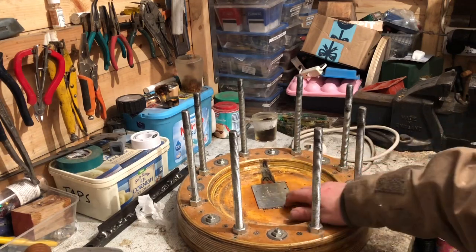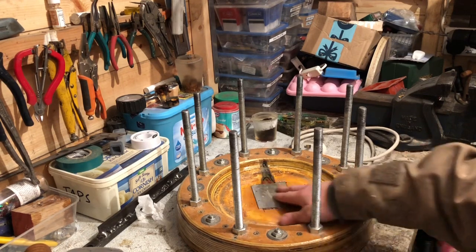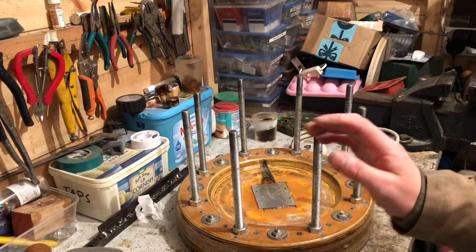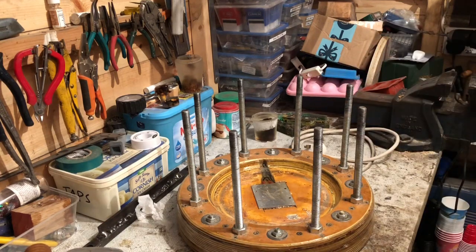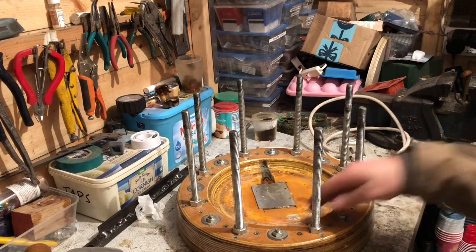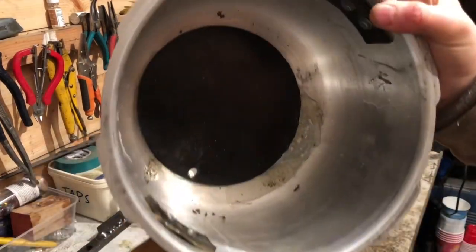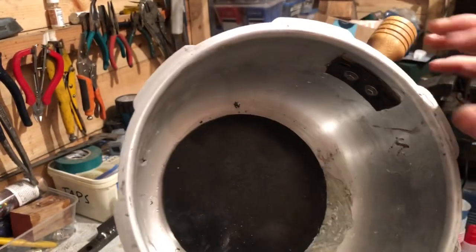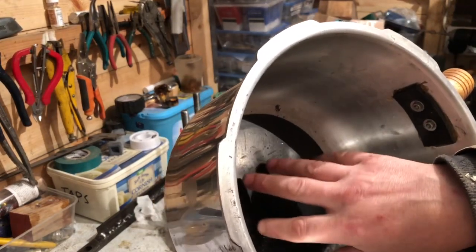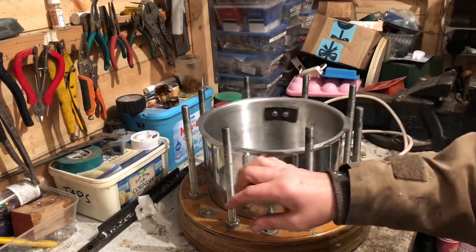That is a heating plate — I think it's about 30 watts, it might be 20. Sitting there it'll heat up quite hot, up to about 70–80 degrees. It doesn't heat up that much when it's got the pot on, as the pot dissipates some of the heat. It just plugs in and has its own little thermostat — it doesn't get any hotter. That's buried in there so the pressure pot sits on top. Inside there's a thick bit of rubber — it isn't supposed to be there; I had a resin spill and it cured in there, so it's staying. Thick neoprene, some form of vulcanized rubber.